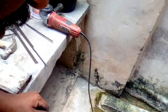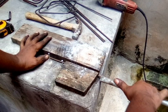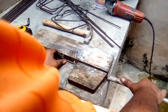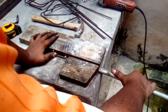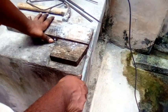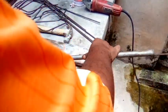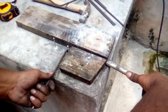Right, so come back again and take. So here, this is 9 inches. Here is 6 inches, well 6 1/2 inches, right? Now the beam I'm using, what I'm going to tie will be about 6 1/2 to 7, right? So watch again, you pull it, you have your piece of steel, you bend, then you come back to this small nail here. Now I'm using this nail as my lineup, right?